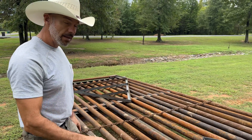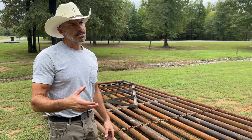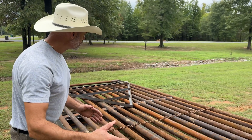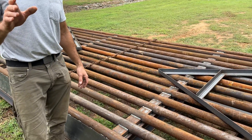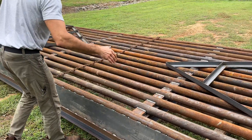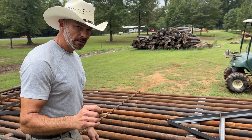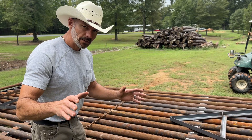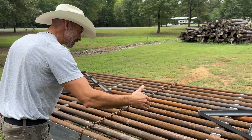The next thing I did — some people either don't understand or don't care — they just space the I-beam out evenly. That doesn't sound right to me, because the I-beam in the middle needs to be exactly where the tires are likely to be. Get an average between your truck and 18-wheelers, stay close to 18-wheelers because they're going to tear it up the worst, and that needs to be exactly where the tires hit.